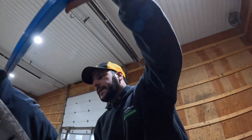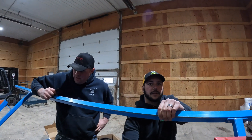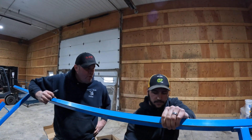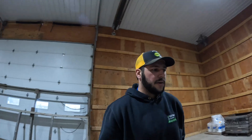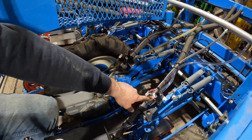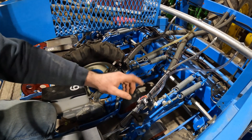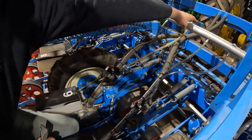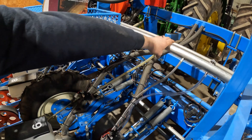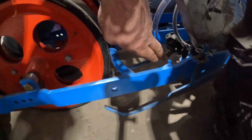In comes Tom. Hi, Tom. Hi, Dylan. What are you doing? I am cleaning up all the wiring and running some new hoses for you on your section shut-off for your liquid fertilizer. That looks so nice! So, these are going to be section control for your liquid fertilizer, shutting off these two rows together — just a shut-off valve. Feed lines from up here to this big line, then we drop it down right here to pop up for the fertilizer.